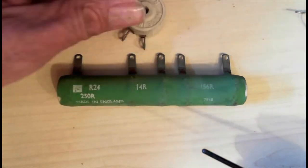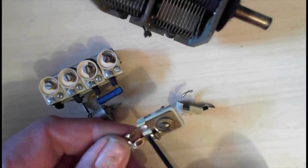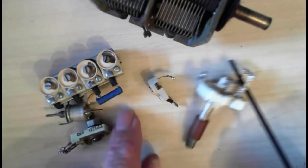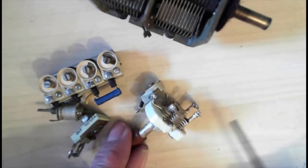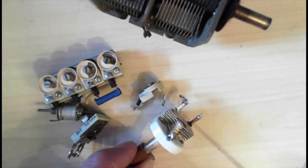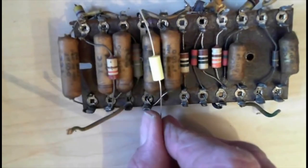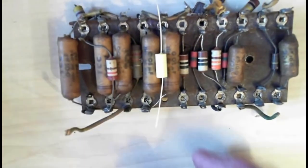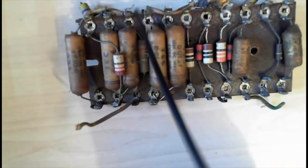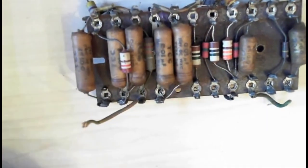What you do is, you wire that. This is the popular sort you'll come across a lot. There's the adjustment with a screwdriver. There's another variable capacitor, a very small one. You won't come across this sort of thing. These are used in communications equipment. In your radio, this is from a Bush DAC-90A. So you use that, you see, across there, like that, to replace all these. Do a nice neat job of it, wrap them round each end, tin these first with a soldering iron, tin the ends of that, make a nice neat job of it.